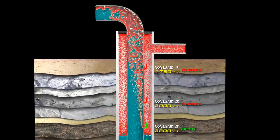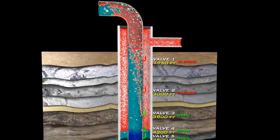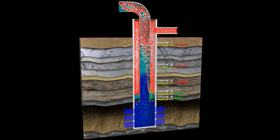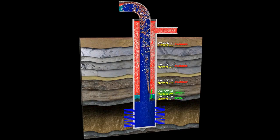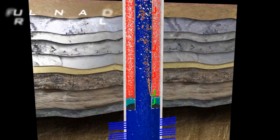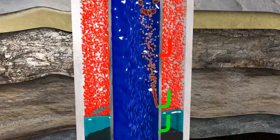Like when the second valve opened, the second valve now closes. The multiple valves in the mandrels at varying depths in the tubing allow the compressed gas to enter the tubing from ever increasing depths until the bottom of the hole is reached. When the injected compressed gas, whose pressure is helped maintained by the mandrels above them, ultimately enters the tubing string through the last valve at the bottom of the hole, the tubing string is said to be in steady state operating condition.